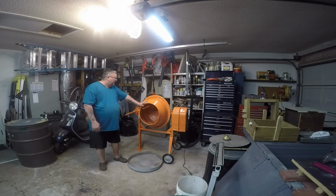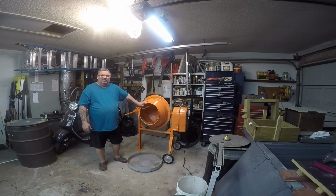Okay. And then with the clay, you put 5% of whatever your mixture is. The percentages are by weight. For instance, I had in a plastic bucket 60 pounds of the sand from Home Depot. So I did my little bit of algebra and found that the weight I need for clay is 3 pounds. Together that makes the 63 pounds that X came out to when I tried to figure out the totality of the mixture.